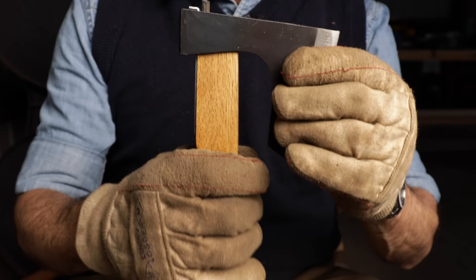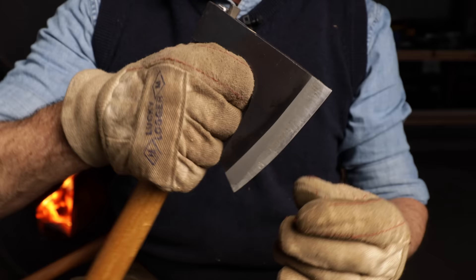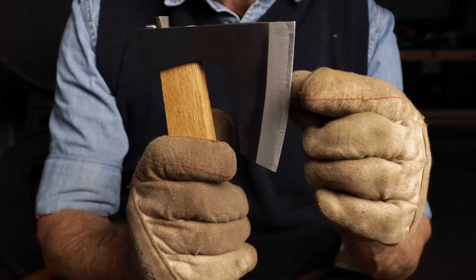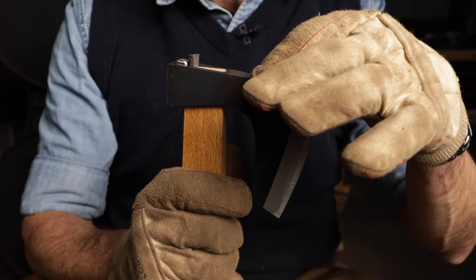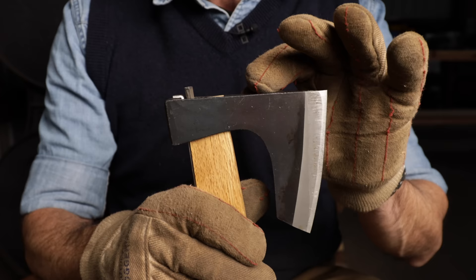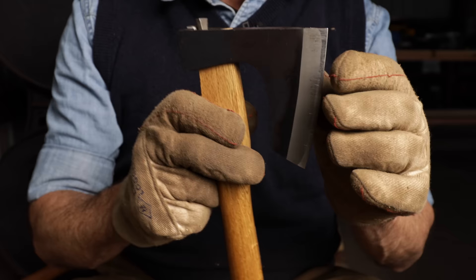The reason for that shape is it helps to get the weight closer down to the user's hand to improve the balance. What I like to see on a bearded axe, like some of the northern style axes, is a comfortable handle up here — but now they have a square handle, so choking up on it to do detailed work is not really an option. But look at the beautiful lamination on that steel. They actually take and split the metal: they use a softer metal with less carbon that's tougher but doesn't hold a good edge, and then they forge weld a piece of high carbon, super hard steel in there. So you have a durable axe that can take a beating and a high carbon cutting edge that will hold its edge with heavy use.